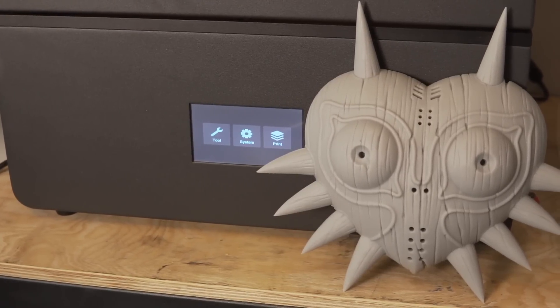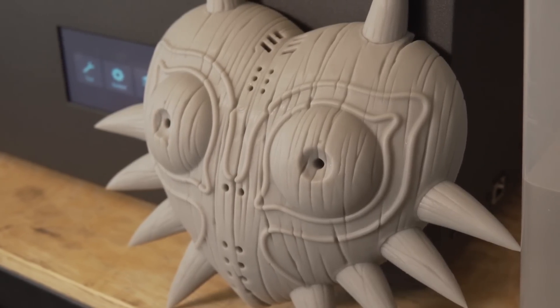Normally at this point you'd want to throw your part into a UV curing chamber, and I still think that's probably a really good idea. However, what really surprised me was when I took the part out of the IPA and removed the supports, it seemed completely dry — hard, no stickiness, no tackiness to it. If somebody had handed me this part I wouldn't have known it hadn't gone into a UV chamber, because compared to all of the other printers I've used it was way more cured. The part coming off of the Phenom was about 90% complete as far as the curing goes. Living in California, I'm probably just going to take my big Phenom prints outside on the patio and let them sit for 15 or 20 minutes. If you're somewhere without much sunlight, throwing it into a UV chamber is still a good idea, but it was awesome just having the part come off and basically be ready to rock and roll.